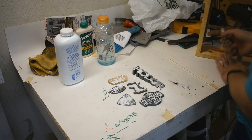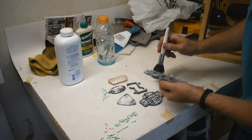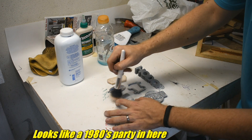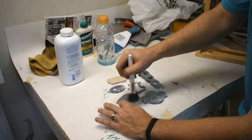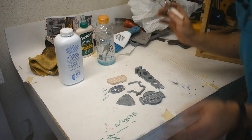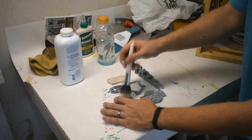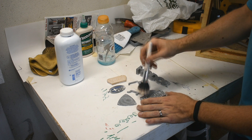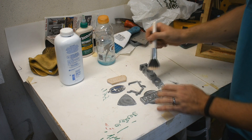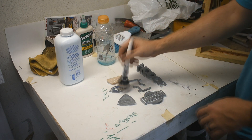The totally not stolen makeup brush. That's just way too much baby powder — it's almost obscene. I've seen baby powder used in other castings and cores, I think on Myford Boy's channel. For some reason it improves the surface quality of the casting — he didn't really provide any explanations but it worked, so he just kept doing it. Okay, that was too much. Please warn me next time before I do that.